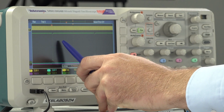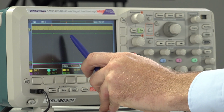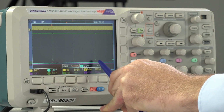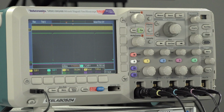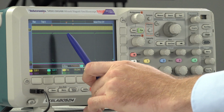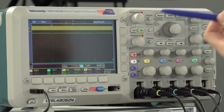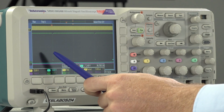Each rising edge of the clock from now on shifts over to the next pixel. After a new start integration pulse, the procedure restarts. As you see, all pixels put out the same voltage. We have a flat line extending between our phases of dark current. The amplitude of about 4.8 volts between the dark minimum and the pixels indicates that the sensor is fully saturated with light. It seems pretty bright in the video studio for this chip.